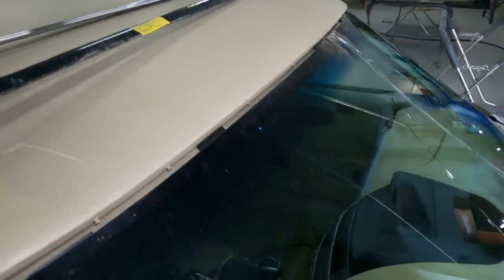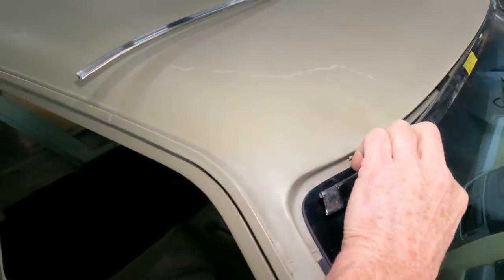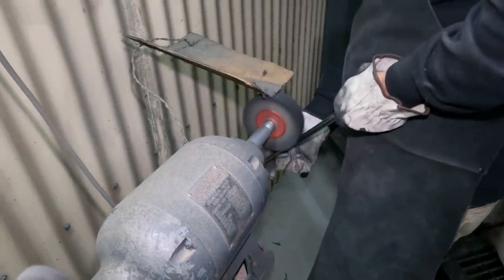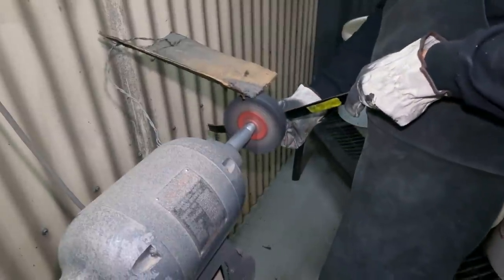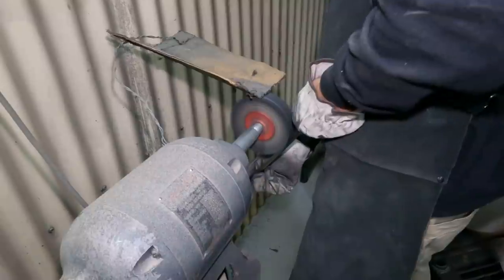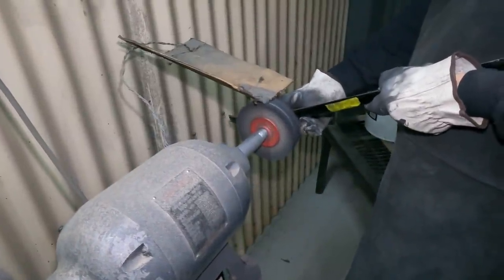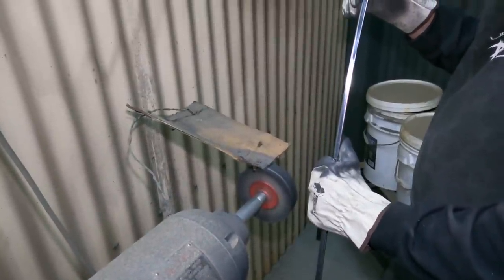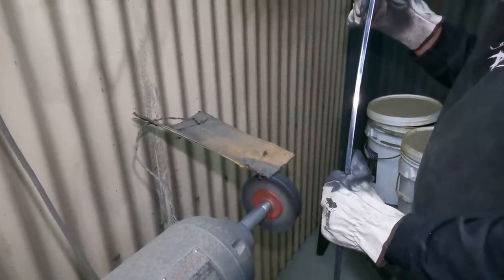When you look down the nice pretty one it's actually not the right shape, and you can see where it's been pulled off the clips. I'm going to clean that black one up now - where the tape is there it's got one little bend in it and that's holding it out on this end when it sits in nice in the middle. One of the issues with these molds is when they get pulled off they often get bent in the wrong direction. By applying a bit of extra weight when you're doing the polishing you can bring the mold back into shape - the heat from the wheel in combination with the right amount of pressure will take the shape and put it back where it belongs, but if you pull too hard you'll end up bending and stuffing it.